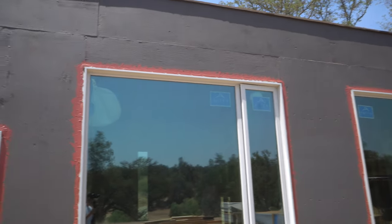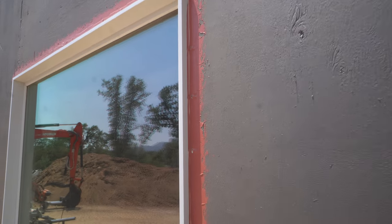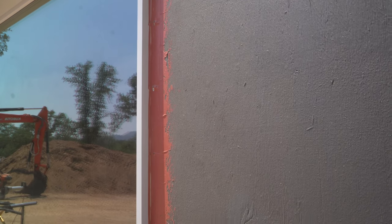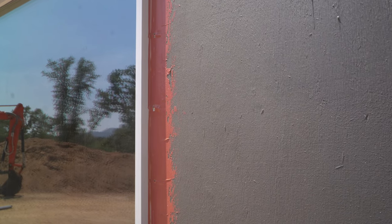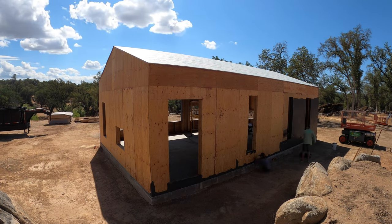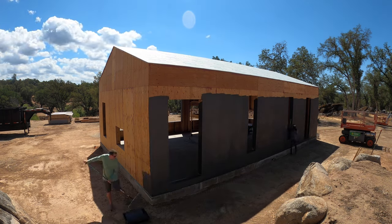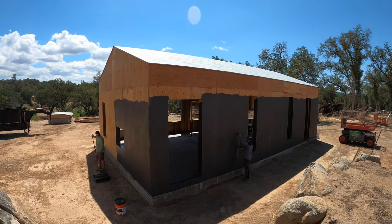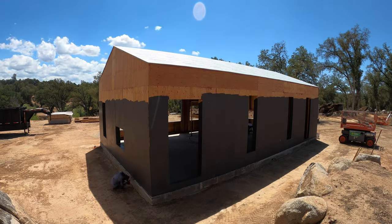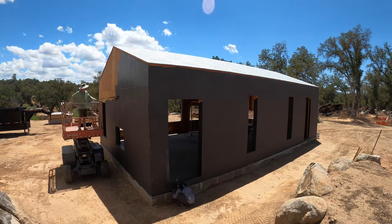The other part of that system you can see is this red coating around the windows — it's essentially a liquid flashing layer. Most flashings are a tape-type product, but this one installs more or less like caulk, so it's not too hard to work with. You basically spread it around the gap between the window and the blue layer, and that also provides a water and air barrier. The blue-gray part was easy to install — just like paint, we rolled it on in a couple of days. The red part is similarly straightforward with a caulk gun and putty knife.